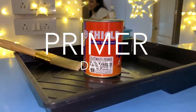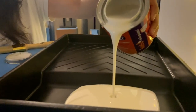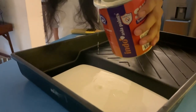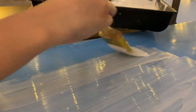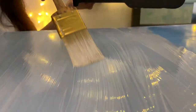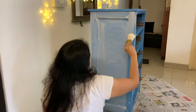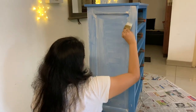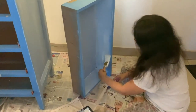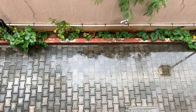This is the primer I used. Using a white primer base allows your paint color to pop and gives it a smooth look — it makes your paint job last longer and protects the wood. I mixed some turpentine with the primer so it goes on smoothly. Turpentine is a thinner that brings paint to the right consistency. Once done, I let it dry — it wasn't a usual sunny day so it took a good 8 hours.